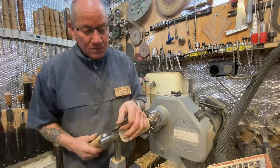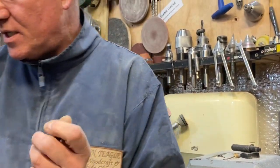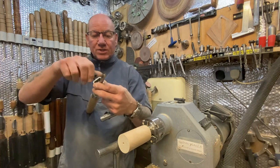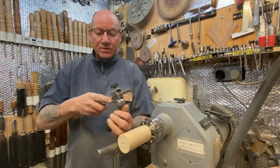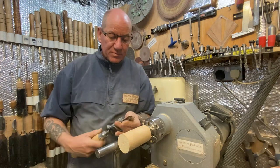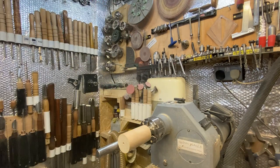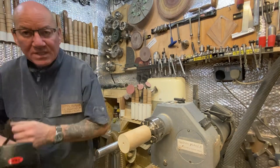Right, this has quite a steep grind but again I'll put a second bevel on it. For sharpening my gouges I use the Tormek. I normally do a two-inch protrusion — I do my grind and then I slide that back off, turn it round, put it back on, come down and that gives me that second bevel. That allows me to come in and roll and cut. With this sort of grind you do more slicing cuts — you don't come in and work on the tip too aggressively or it bites you every time, you get kickbacks. Which you'll see today — the difference in how I use it.